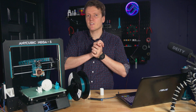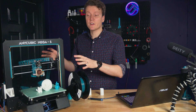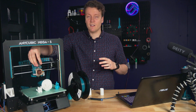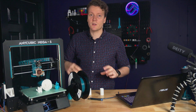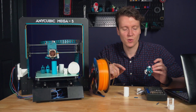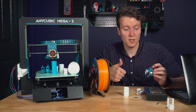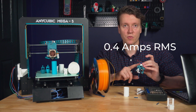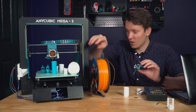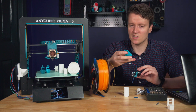The next issue to tackle is gear backlash — how much backlash you want between the motor and the large plastic drive wheel. The motor can be angled to adjust how hard it presses into that gear. You want just a little backlash so you can move the plastic gear slightly without moving the motor gear; too firmly meshed will wear out the plastic wheel faster. Ultimately, bumping my current from 0.35 to 0.4 amps cleared everything up and gave me smooth, consistent prints.